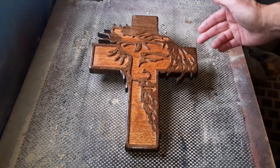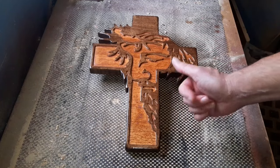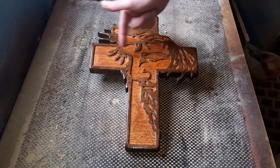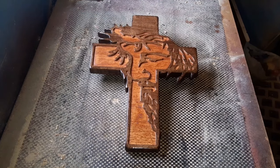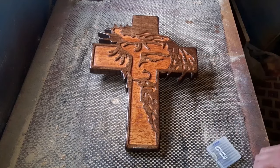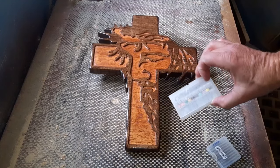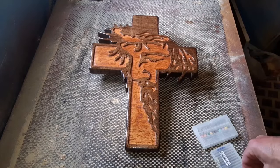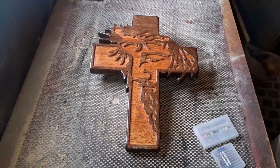So we routed out the cross on recycled pine, which is an inch thick. It measures in at 14 inches by 10 inches across. And if you remember, little CNC bits for all our line work. And then we come in with the good old end milling bits to finish off with. And then we skimmed over with a mouse sander with the flexi cable. If I just find it up here.